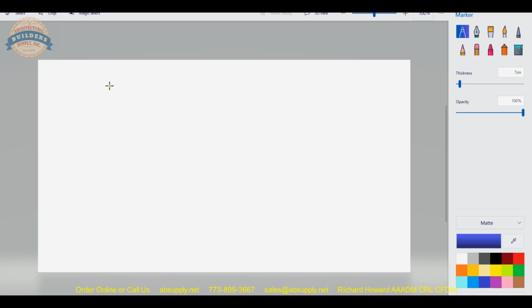Okay, so if we have an unusual circumstance where we have a cased opening frame, but we want to put a door into it, except that the door needs to reside, let's say, deep inside of here. A standard hinge is not going to really permit that to work at all, because a standard hinge is meant, whether it's a cased opening frame or a double rabbeted frame, doesn't matter, to reside here with the leaves and the door existing here.